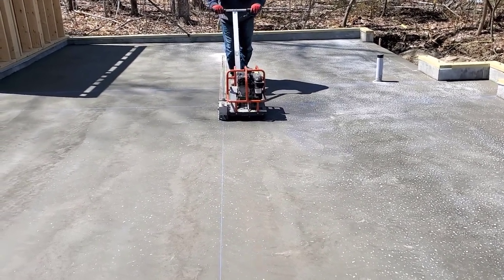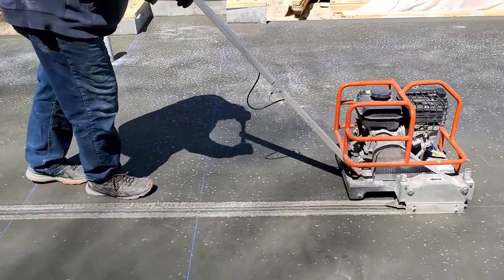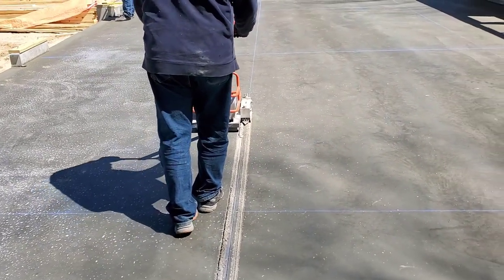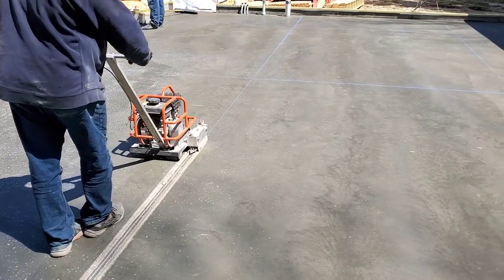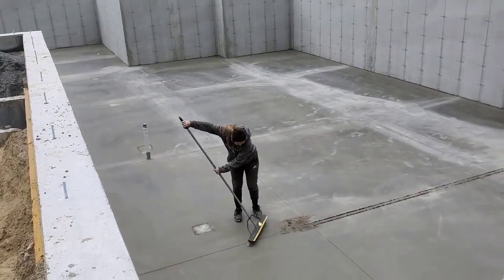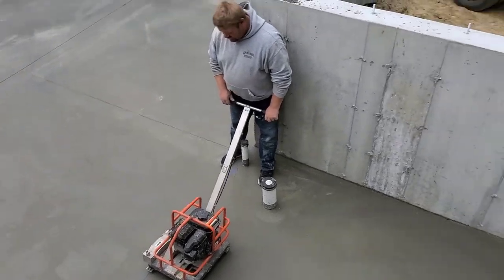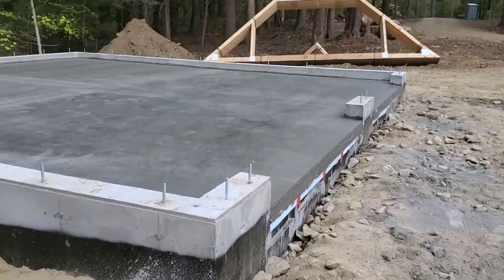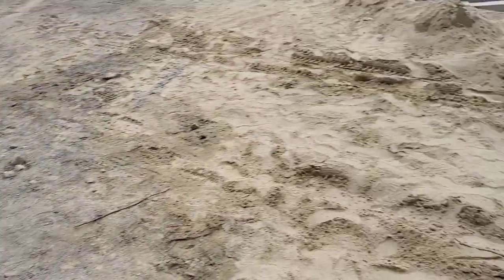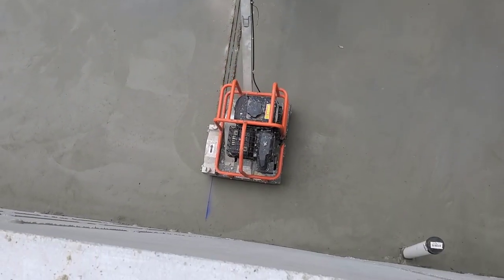It cuts them in so fast that you can make sure you have plenty of cuts in place, and then you're done. You leave and go to the next job and you don't come back to this one. When I first started 40 years ago, we didn't have these saws — we'd always have to come back the next day, and it was just a lot of extra travel. You'd show up the next day and sometimes the floor would already be cracked. We have none of that anymore. You can see all the cuts we're putting in, especially off these reentrant corners right there where Luke is — it always cracks off those. About 1 p.m., started here at 7 a.m. pouring, got the garage all sawed. That's it, guys — I hope you learned something. Like and share, and thanks again. I'll see you on the next one.